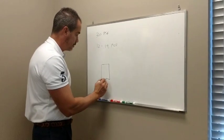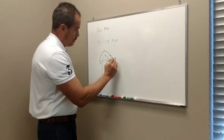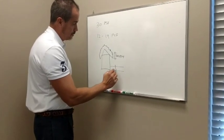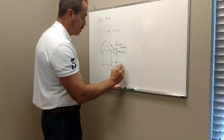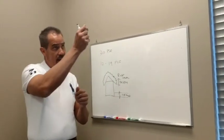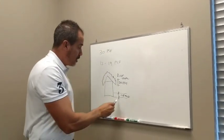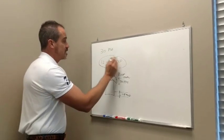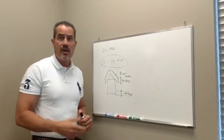Let's draw a simple roof structure with snow on it. We'll call this the depth of snow on the roof, and then you've got snow on the ground — so this is roof snow load and this is ground snow load. You can measure the roof snow depth by eyeballing it or putting a measuring tape up there. Do not get on the roof, but you can safely measure the depth from the ground. That is a known quantity.